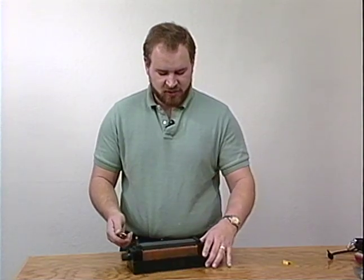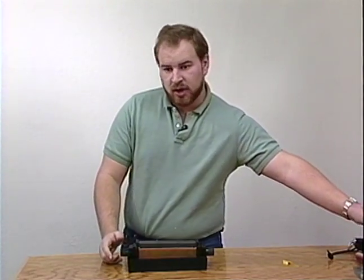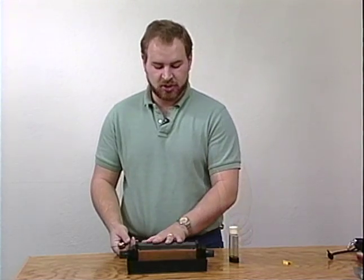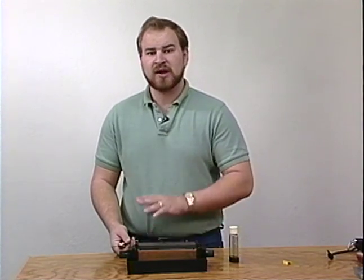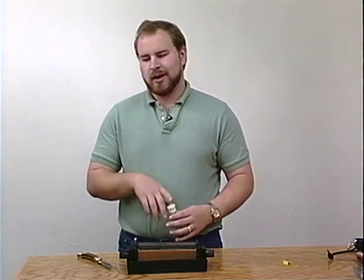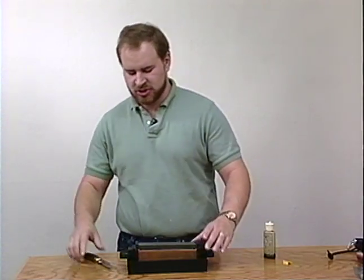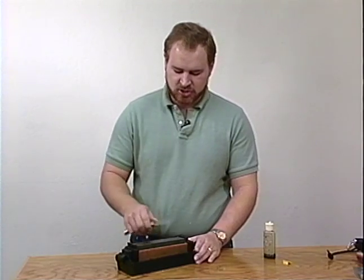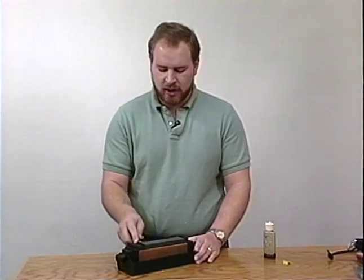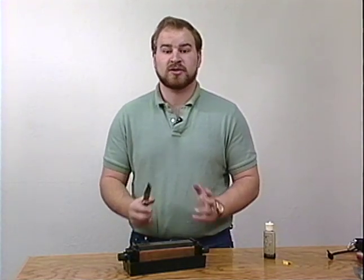As far as the stones are concerned, this is what they call a multiple stone — you have the medium, coarse, fine, super fine, and so on. One thing you want to do whenever you're using a stone: you want to have some sort of liquid on it — let it be oil, saliva, or water. The reason why is to lift the metal particles out of the stones so they remain porous. If they do not remain porous, it's like going over glass and it's not going to do anything. They sell sporting oils but I use kitchen oil or saliva — just a little bit. Do it consistently — a lot of people set it up in one direction and just do that five or six times. After about five or ten strokes either way, go back and check your blade again. Is it sharp? If it is sharp, stop. Don't destroy your knife.